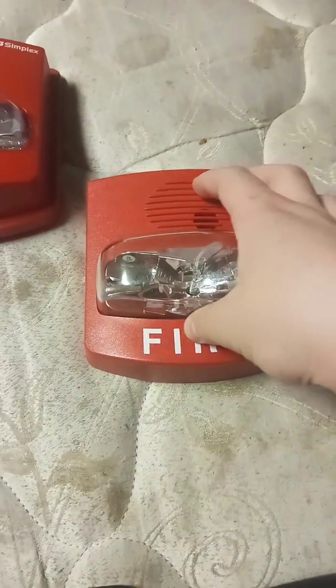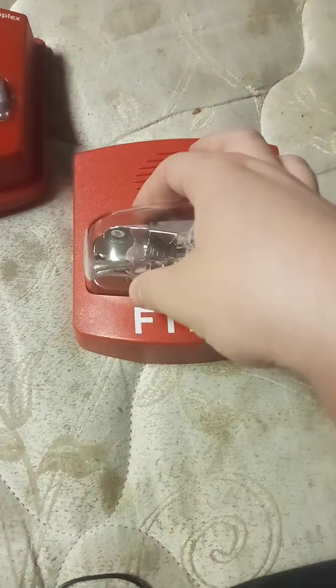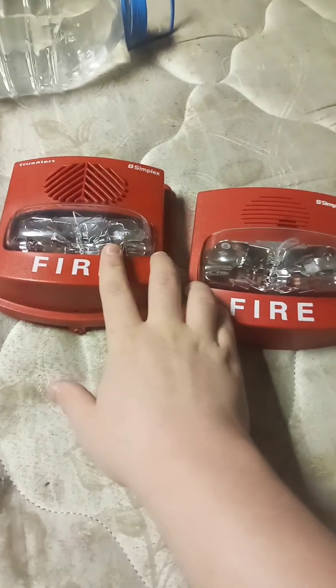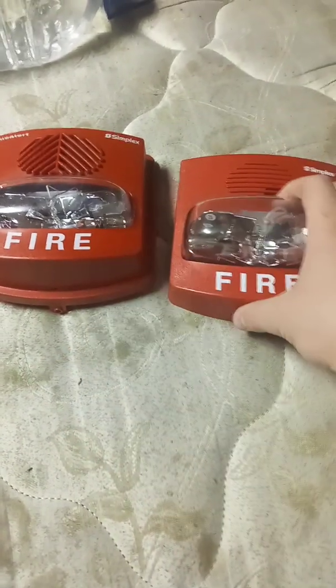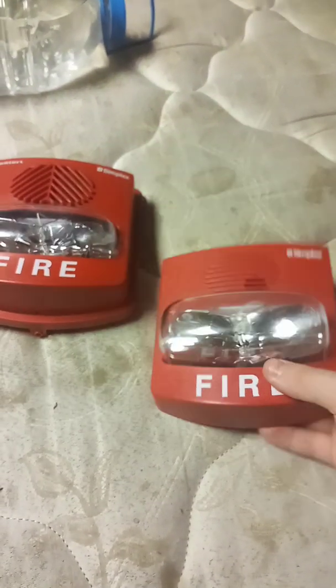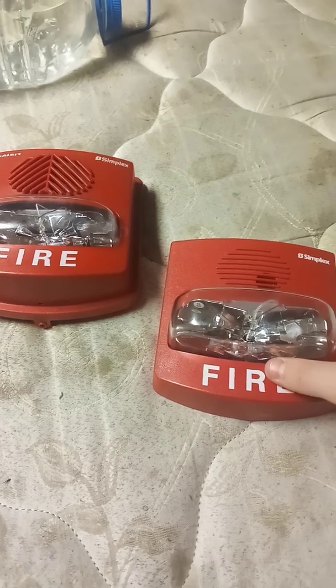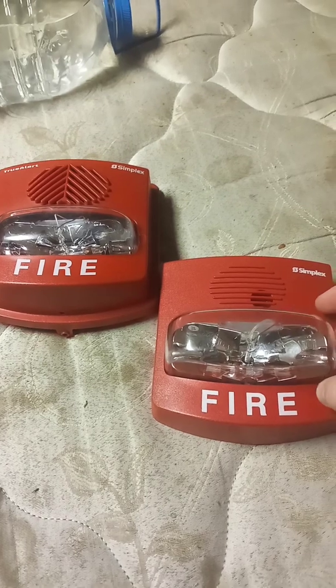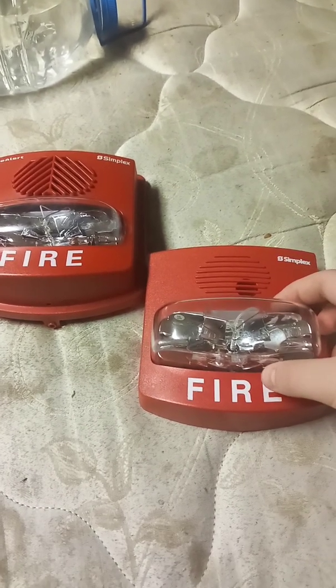So particularly with this one, once you apply power to it, since they are smart sync, they are less user friendly than this device. Which means that the smart sync nature of these devices handicaps your ability to use them, unless you have the SCM, or you could even bypass the smart sync protocol with just a conventional NAC on any panel, but I'll get into that later.